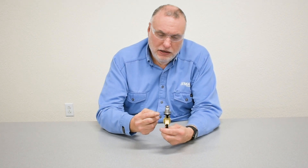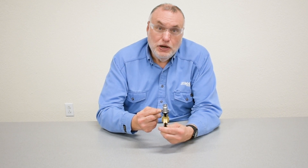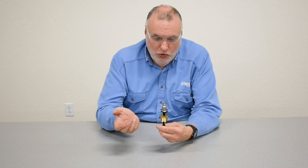A special case for hooks is a hook found on a chain hoist that has manual lift, which is a handle mounted at the bottom near the hook for the operator to use with thumb controls. The top of the hook shank is designed with an anti-rotation pin put through it. We find many times this pin had been removed so that the hook would swivel up inside the clamping mechanism for the manual lift. This is improper.